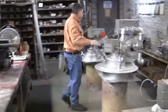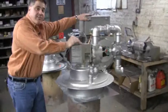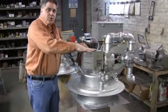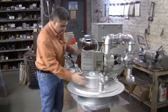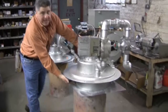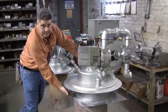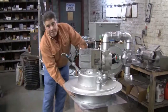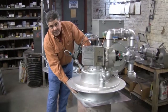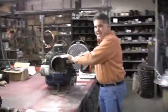What we're looking at here is an Inferno Therm 2.8-million BTU Model 400 burner. This is a gas-oil combination burner. We use all UL-approved controls. As you can see, the air turret — this is a refractory poured gas base. High-temperature refractory is poured, air-dried, and then kiln-dried. This protects the head of the fire of the tank, keeping the fire five inches inside the fire tube. The competition uses a thermal blanket — it's not as safe.